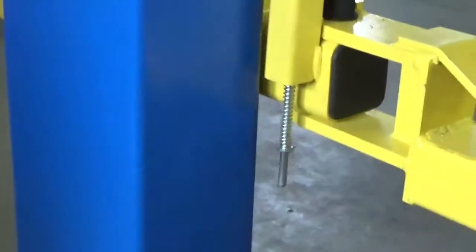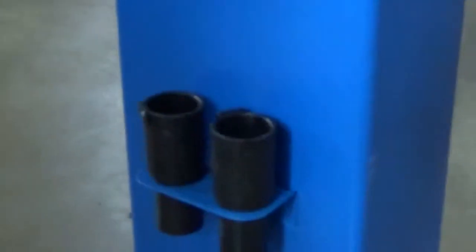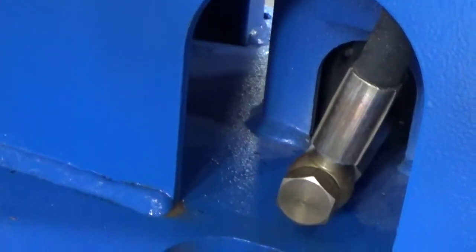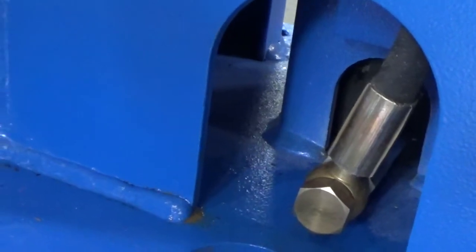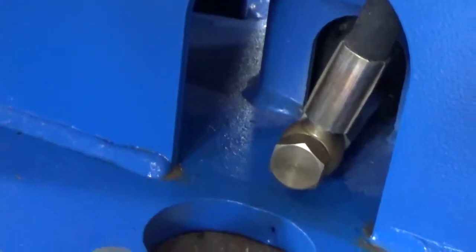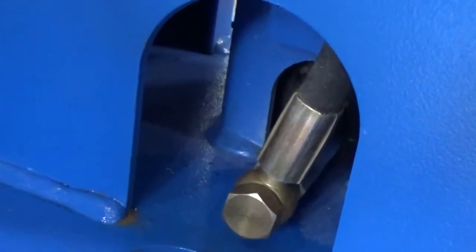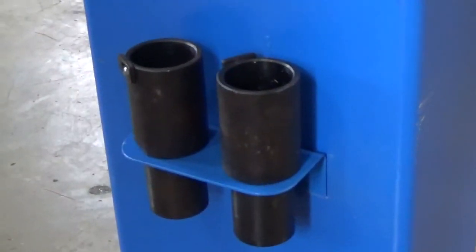The little black guard comes down and connects to the bottom of the cylinder. On the bottom of these cylinders you'll see there's a fitting - what they call a castle fitting or banjo fitting. It's like a bolt with a couple of holes cross-drilled and a large hole in the center, and it'll use a little crush washer on each side of the hose. Always check that the banjo fitting is tight before you push the button for the lift to go up.